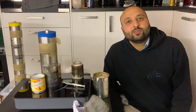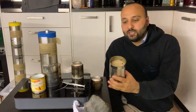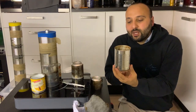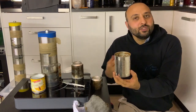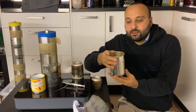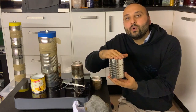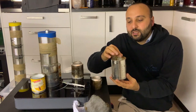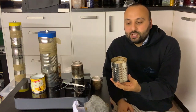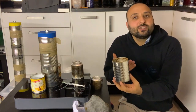During the past days I decided to work on the engine a bit more to improve its performance. The first thing I noticed is that in the original design we had only one can, so when we apply heat to the lower part, after a short time — maybe five minutes or more — the top part of the engine gets very hot. Because we have a balloon on top that works as a piston, eventually the balloon will go bad and maybe burst. Of course we can cool the top part with water or forced air, but that is difficult to implement.